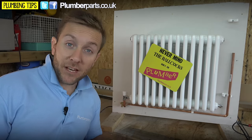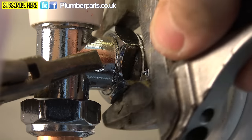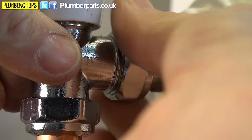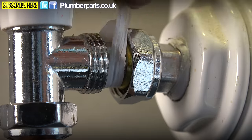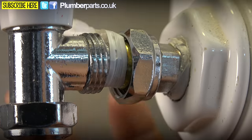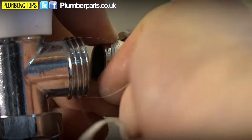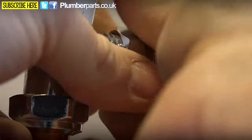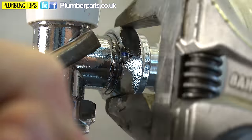The best thing to do is shut down each end of the radiator and use the bleed key as well to make sure those valves are holding — just like we did before. Then use your set of grips to undo this nut, completely slacken it back, and try to expose the face of the olive. You'll need to get yourself some PTFE or some Boss White and wrap that round the olive — again, pay attention to which direction you're putting it on, so that when you tighten the nut up it doesn't unravel the PTFE. Pop this back on, then re-make up the joint by grabbing the body of the valve and tightening the nut up again. In most cases, that's all you're going to need to do.